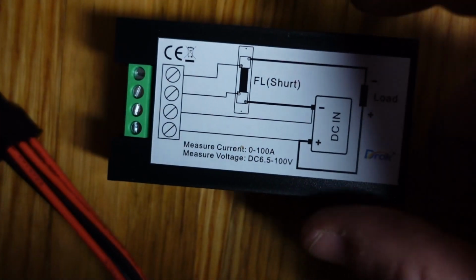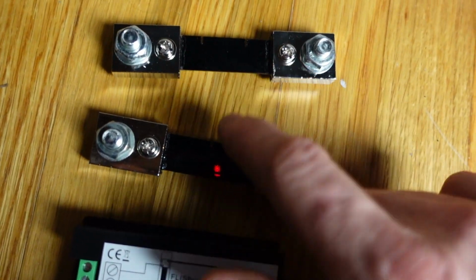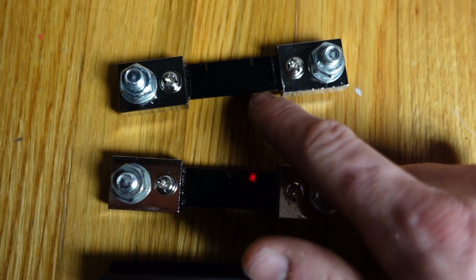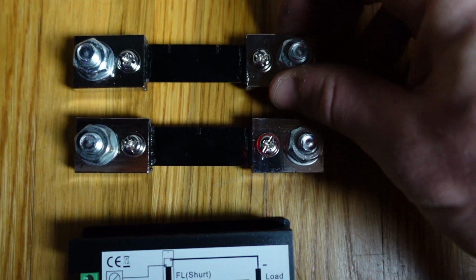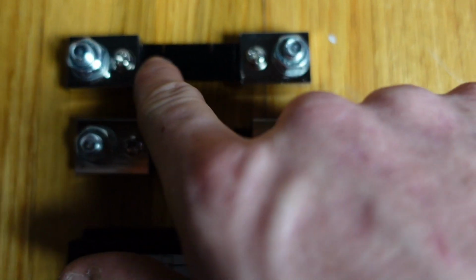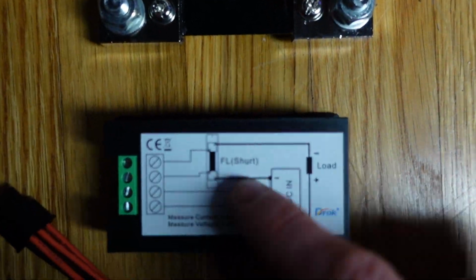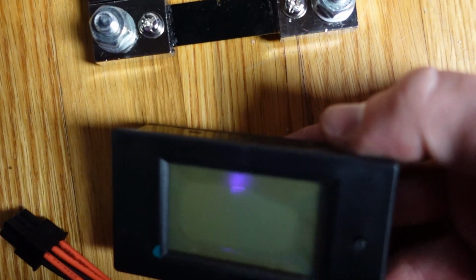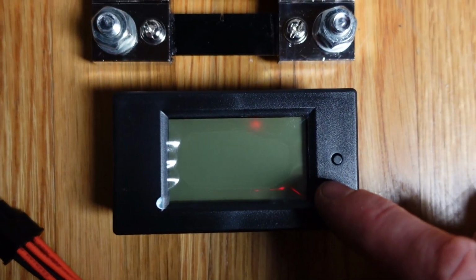And that's why it's not perfect, but these ones are very close when you start reading all these wattages and stuff, right? And so I'm going to find another meter where it comes with one of these shunts and the same thing. This, by the way, this is called a shunt, right? This thing, this with the resistance in here, the little resistor, right? And when you do that, you can also fine-tune the meter. Now this meter was only $17, it's very cheap, but I think for like 30 or so, I'll look for it. I'm going to do some more videos about it. There's a calibratable one where you can fine-tune it, and that like 10 watts that I've been showing this whole time or so.